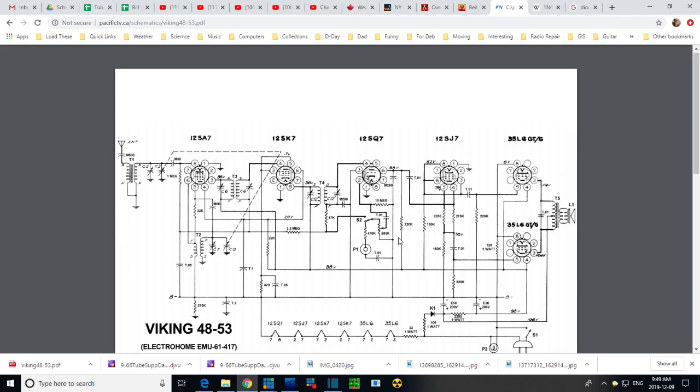Maybe T means tubular, and then S would mean non-tubular. Sure. Here's this S and F thing happening again. S and F. Start and finish. That's what it is. It's start and finish. That's a common way of dealing with coils, is to mark a start and a finish. I guess that helps you keep the phase arrangement correct, so you don't lose track of the phasing of the coil. That's probably where this start and finish thing has come from.